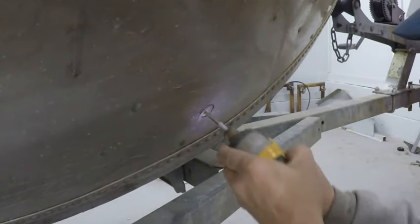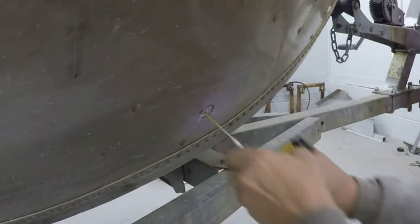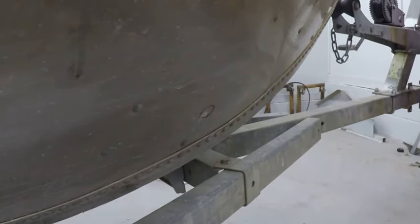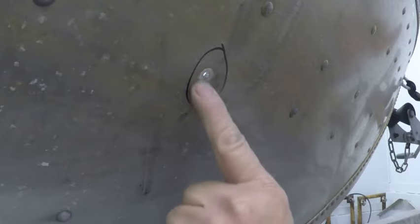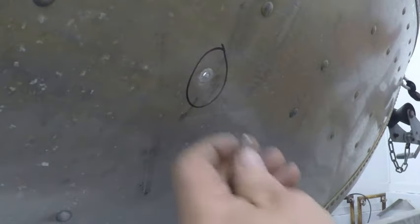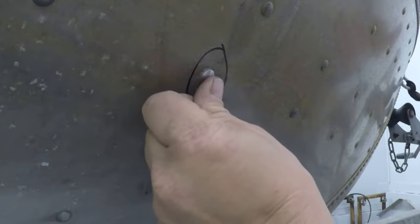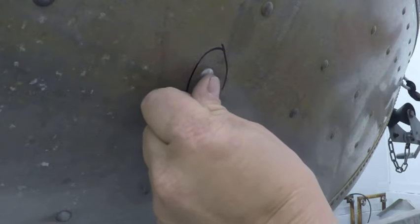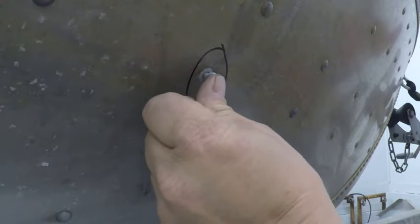I'm cleaning the hole - don't waddle the hole out, just clean it with nice smooth straight strokes. This is a 3/16ths bit and these are 3/16ths solid rivets. Now that it's drilled out, I'm going to take some 120-grit sandpaper and clean this area right where the rivet is sitting so there's no corrosion and I've got clean new aluminum. Then we'll stick the bucking rivet in. You want it to go in where it just barely moves - the hole is just maybe one thousandth bigger than 3/16ths.